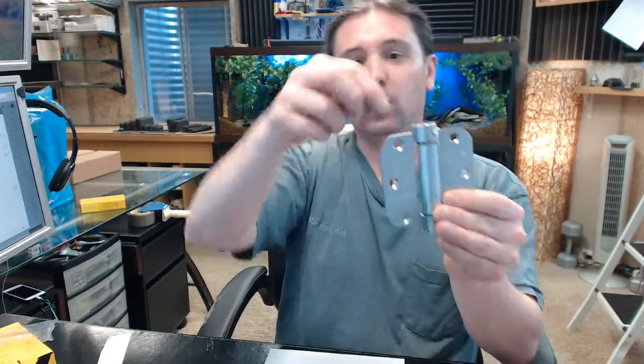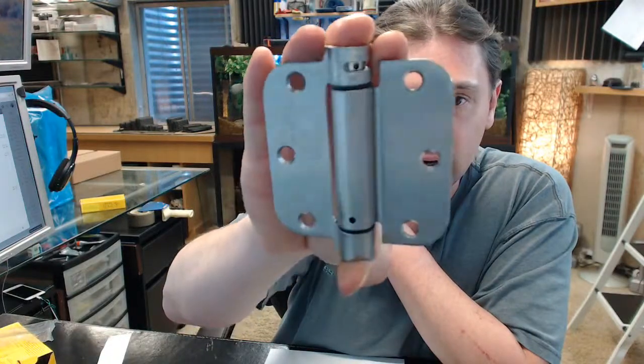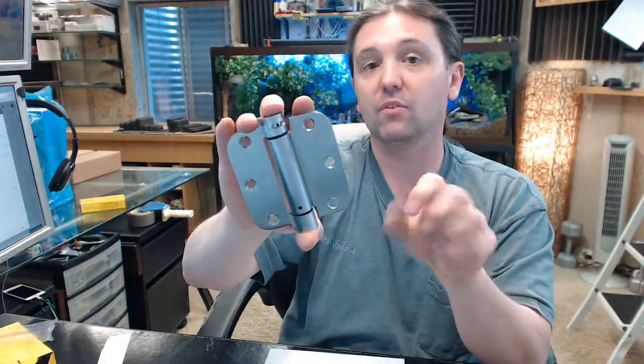Now that 1.25 inch diameter will leave this 5/8 radius, and they're really making just one pass in the door. Well, one pass in and then up, and it's done. There's not a lot of prep to do. They don't have to go back and square any corners, so that's why you're going to see this. I like this 5/8 radius. It's nice, clean, and gradual from Cal Royal. I've seen other hinges where it's not truly 5/8 radius. It's a bit odd. Not that that's a big deal, but I appreciate how proper theirs looks, is what I'm trying to say.